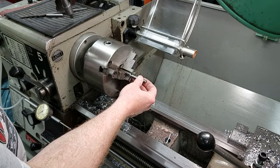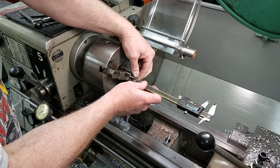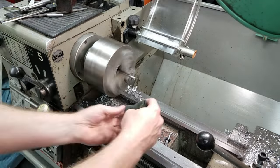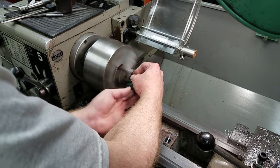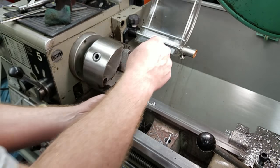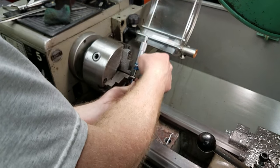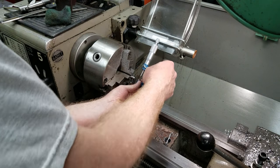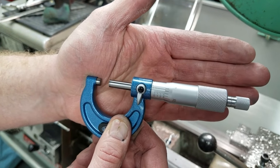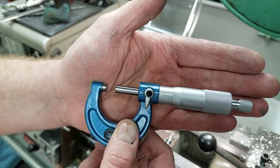To cure this, I took the pins over to the lathe and chucked them up with about half an inch protruding past the chuck so I could take some medium grit emery cloth and reduce the pin diameter. If you look closely at the micrometer, you can see that the case side of the pin measures about 0.3226 right now, just right for a slip fit into the blower case hole.